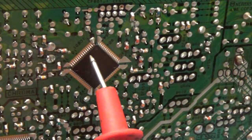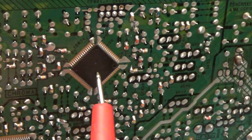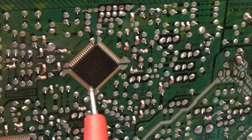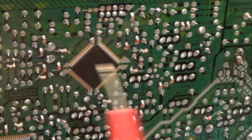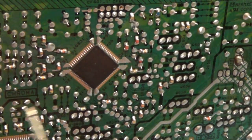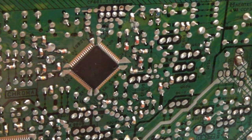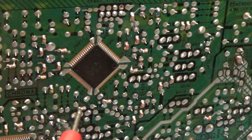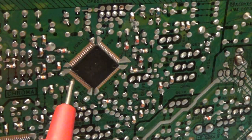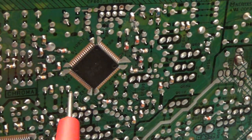There's a million different ways to do this and this is how we're going to go. What I'm going to do now is get a 2K resistor, find 5 volts on this board and find ground first. Then probe each of these pins until I find the specific colors, solder wires to these specific pins, and we'll go from there.